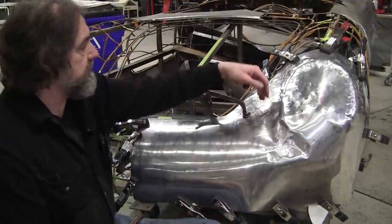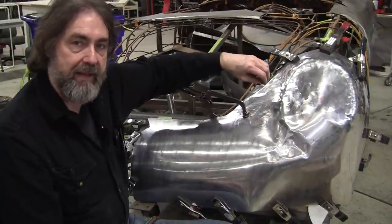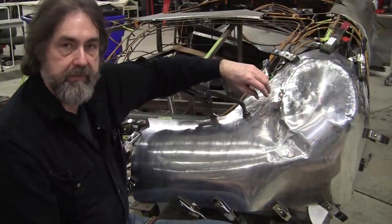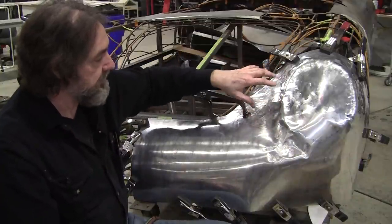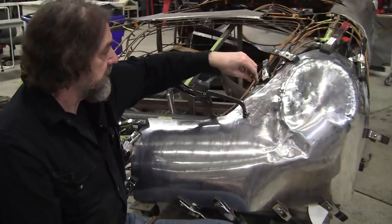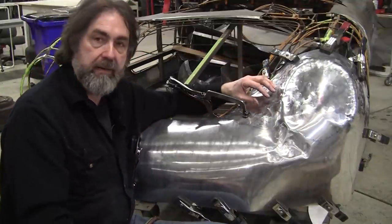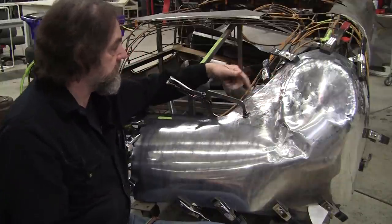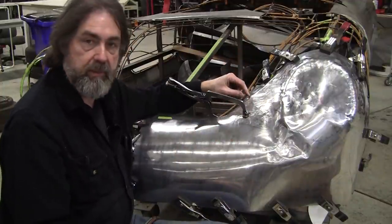And you either have to do some kind of operation like this, or you have to figure out exactly where you're going to change that surface area value. Something like this reverse curve in here can be a really tricky problem for a beginner, even for an advanced person. And the other detriment, if you figure it out and you try to do it by stretching this edge, you'll get it to lay down, but this edge will be really, really thin.